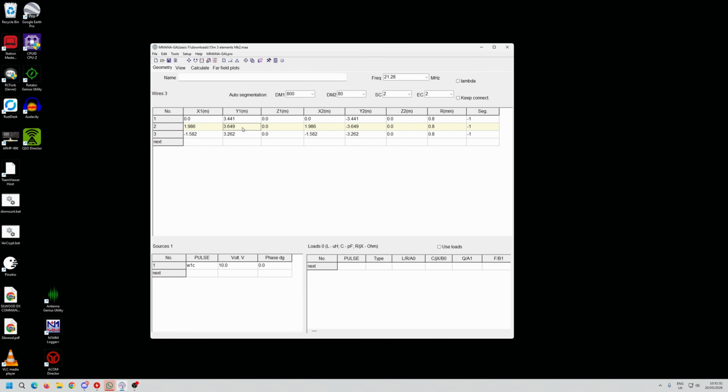I'm going to cut it a bit long because when we go to the 4-element 6-metre beam, it might stick out a little bit. Maximum element size is 3.65 metres both sides. So we'll measure these poles behind us and we'll build everything the same size, and then we'll just use wire as the elements. Let's get the hardware built today, forget the wire.